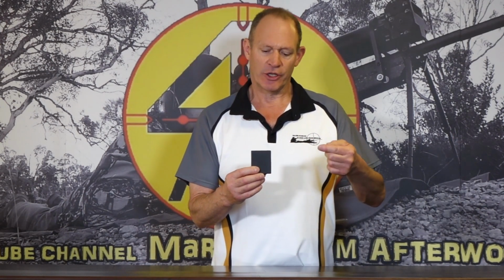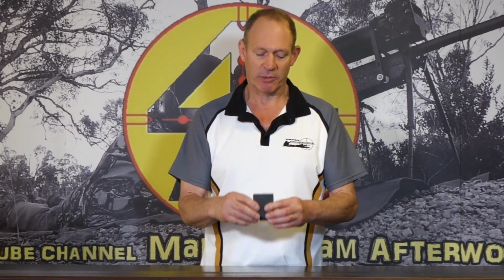These square looking things that run in the front of the muzzles fit all those needs. It meant that it's big and square. Some people like that, some people don't, but it is the nature of the physics of getting that air going straight and keeping it by your face by having it wide. It also makes it a bit more complicated to machine. Being such a long cut through there, I get a CNC shop to do it. They're not just using a mill end, they're going through a thing called a wire cutter. So it takes a bit more setup, takes a bit more time. They are a bit more expensive to machine.